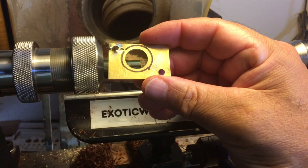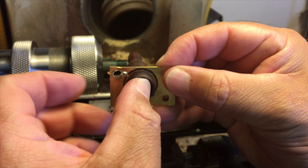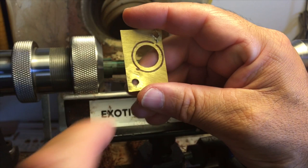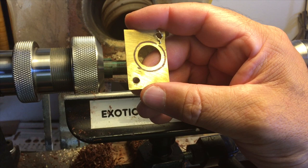I took a piece of brass — I don't know what thickness this is, but it's a piece of scrap I had left over. I just drilled this out in the drill press using the same drill bit I used to drill this out with. You can see that it fits in there like that. That's going to be a decorative ring before I put the wood on. I've got a little bit of a line — I just need to cut around that. Being that I don't have a metal lathe, this is the way I chose to do it: just drill it out and then cut that around using my regular bandsaw with a metal cutting blade.